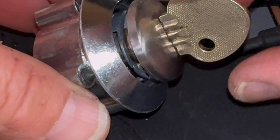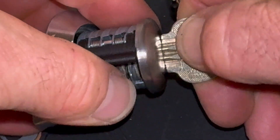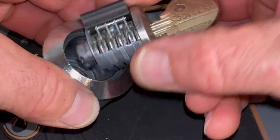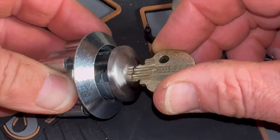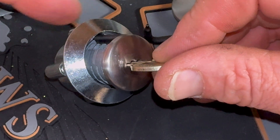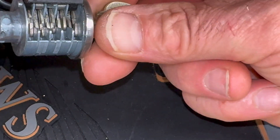You can see it can spin around inside there. When you take the key out, the levers are no longer aligned, and so this central part will only fit in where you've got the groove in the actual lock body itself and it can't be rotated. So a very, very clever system.